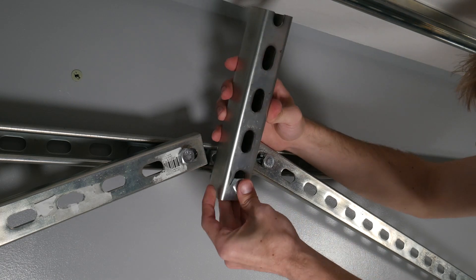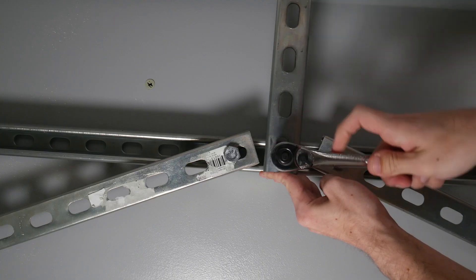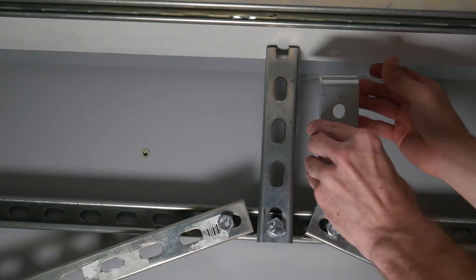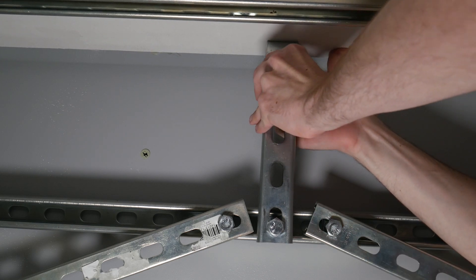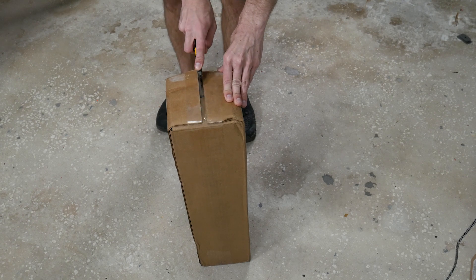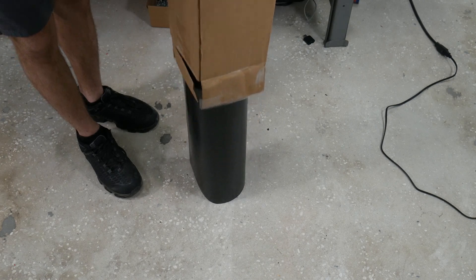So there was still a good bit of bow in the main tabletop, especially in the back. So using a small piece of strut, we pinned the tabletop in between it, and then used a shim of an L-bracket to make sure it was super tight, and that eliminated all flex that was there. The next part, and always my favorite part, is putting on the ESD mat.